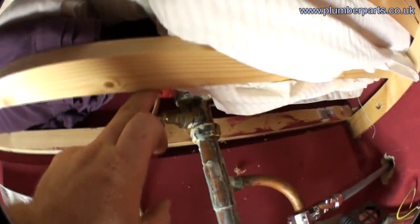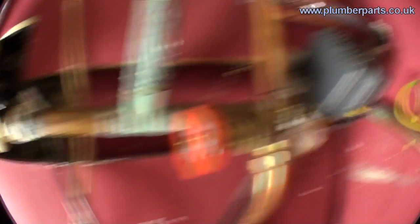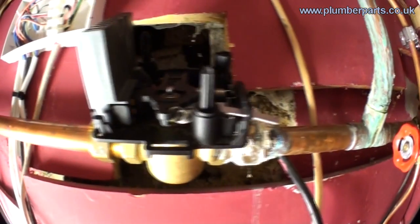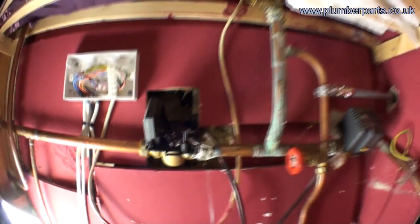Let's have a look at this S-Plan system in situ. We have our boiler flow coming from here, going up there and across the top to the pump — which you can see just here — and then it comes down to this T-junction. It can either go off via this valve to the hot water cylinder to heat the hot water, or via the faulty valve we're replacing to the heating system. They're generally controlled by a programmer and a series of thermostats. The good thing about an S-Plan system is you can have as many different zones as you like — underfloor, different radiator zones, different cylinder zones — which makes it a lot easier to control the services in your home.